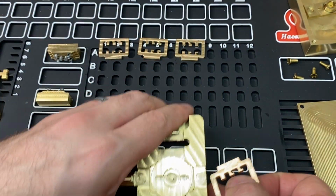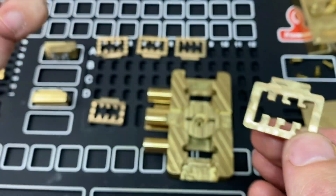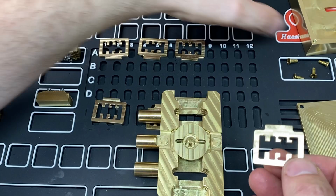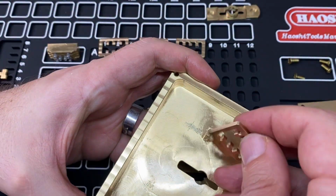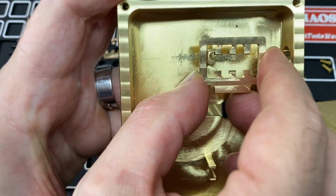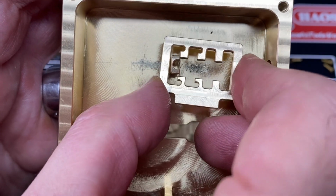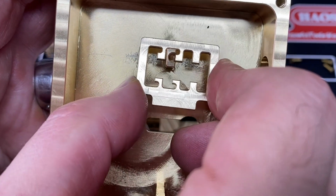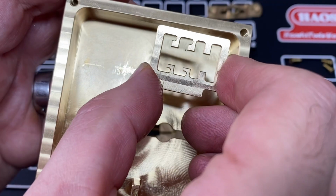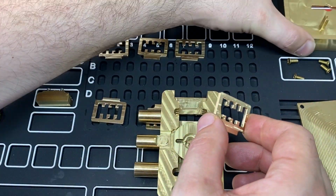You can see here, put that there, the gates and the traps there, the false gates, which are designed to catch as it slides across these bolt stumps. So you'll see here what I'm talking about. As this is going this way, if it's lifted not high enough, then it'll catch here. If it's lifted too high, it'll catch here. Either way, and then we move it a gate, and then you'll see it catches here or it catches there. Move another gate, and then you might be okay. But either way, you've got 3 gates there with those traps. It's really quite well thought out.